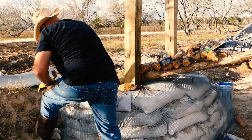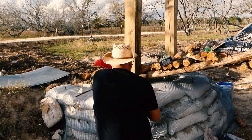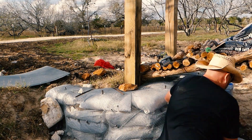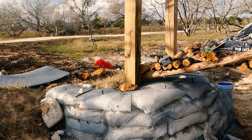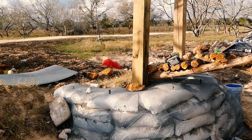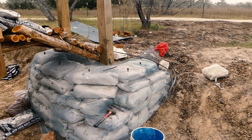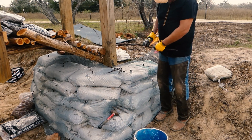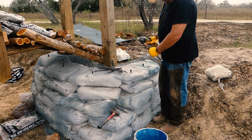I got all the little pieces of wire. When I'm done with the leftover wire I'm going to put it over the bridge arch and put that in concrete so you won't see all of those logs - they're just there for form. It took me a while to cut all of that rebar. Every other one I'm cutting at an angle so I have a sharp edge then a flat, sharp edge then flat - I'm just making spikes, roughly eight to fourteen inches. Whenever I find a bend I use it to bend back against the bag. Even the bent ones have a purpose - they bend perfectly against the bag pulling the rebar and wire mesh tight.